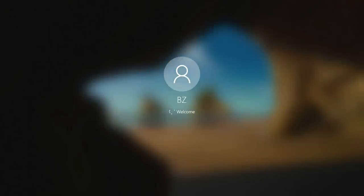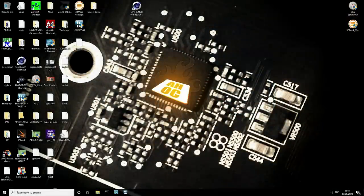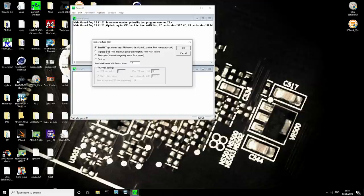Because if you're on say a 6 core like this, well, having half your cores running 50 megahertz higher or 100 megahertz higher ultimately means that your average overall overclock only increases by 50 megahertz, right? So if the gap between the CCXs is like 50 megahertz, then you may as well just go the same clock for all the cores at the same time. Which, looking at how this is behaving right now, I'm very strongly considering that option.